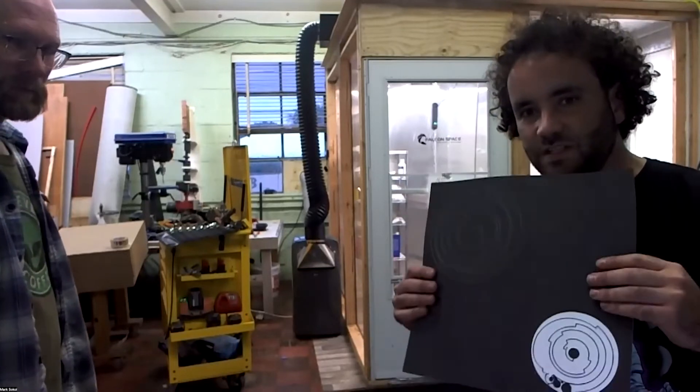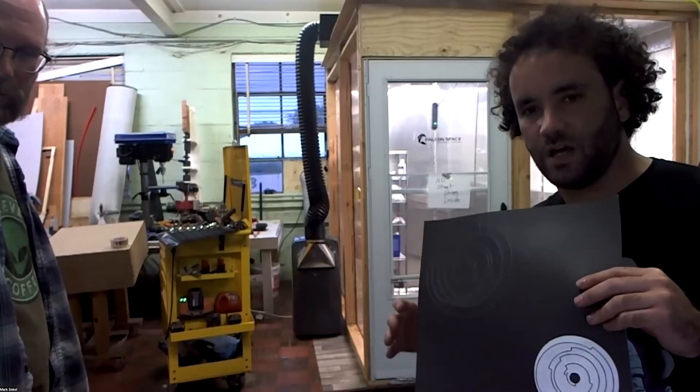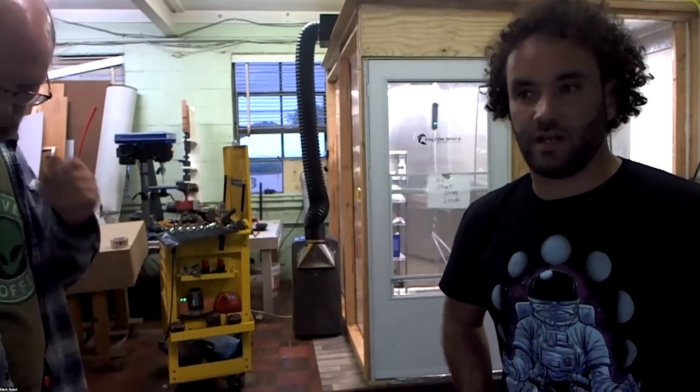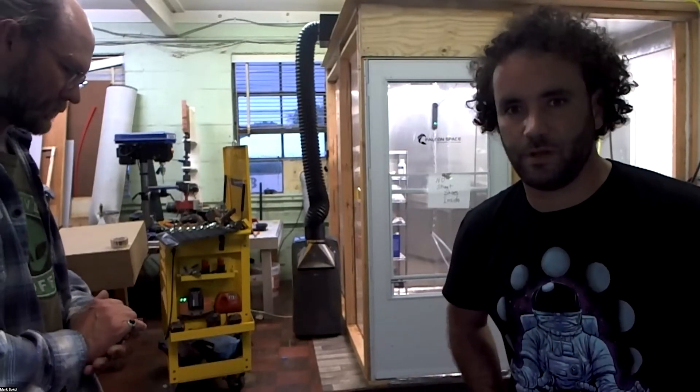Mark has a fabulous network of advisors. We've had people with serious scientific experience come in — we had a brainstorming session after we got the skeleton up and sealed. For the vapor deposition stencil technique: this is the negative — we could put this on the vapor deposition machine and make David Perez's fractals out of any material, layered too. There's also a rumor going around that super thin films of bismuth are superconducting — so maybe copper with a little bit of bismuth on the edge could be worth trying.